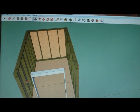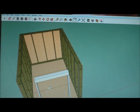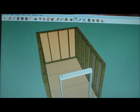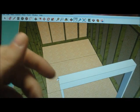Okay. Well, normally when you build a 2x6 header, that's as thick as a 2x6. Usually it's built up by three 2x6s, and you have two half-inch pieces of plywood for spacers or OSB, or you have three in a row and then you have a 1-inch piece of foam. But let me show you what I'm talking about. I'll go ahead and draw it real quick.